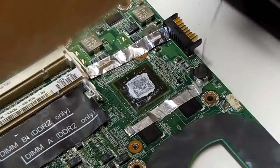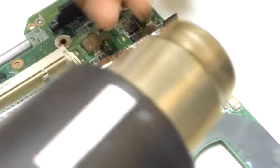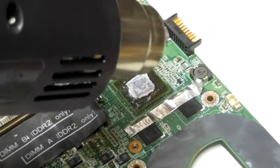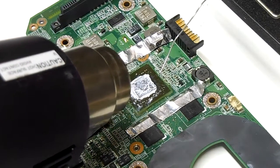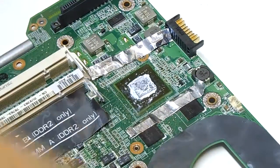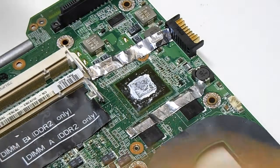In order to get it to the right temperature, unless you have a temperature probe to set it exactly, I use a reel of solder. I will turn the gun on, point it at the solder, and slowly turn up the temperature until it melts solder at about an inch from the tip. In which case it should be hot enough when you put it around the chip. I've already calibrated mine, so you're on your own for that one.